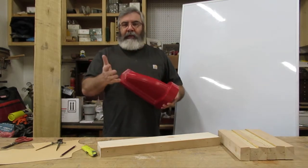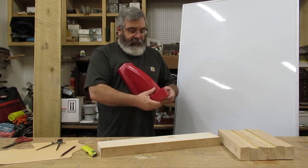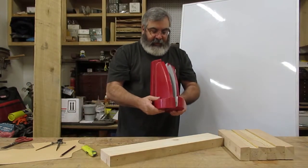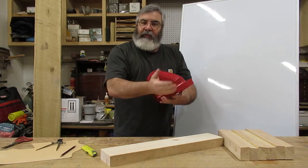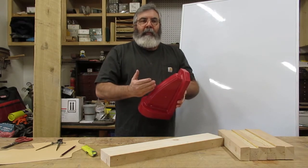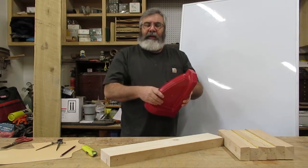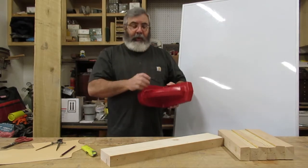There are just two little spots here and the surface area is small — you're probably not going to be able to see it. What I did was take a flat chisel and it just popped apart, and it was close enough where I could take a little sandpaper and get it. You're not going to get these things 100% perfect. If something tore out really bad I could take a little more Bondo, but they broke pretty clean. If I was putting a bigger fillet in there I would have done both halves separate.